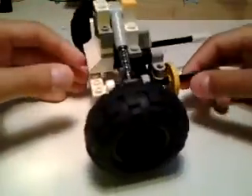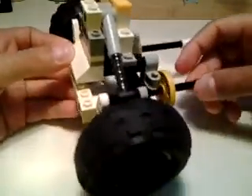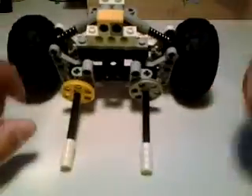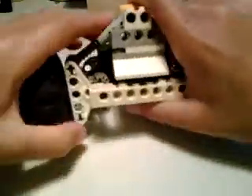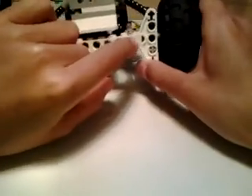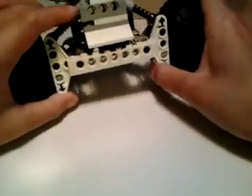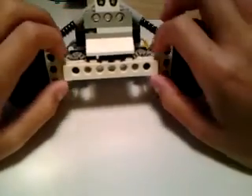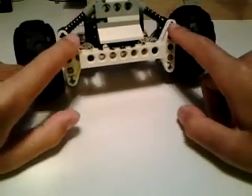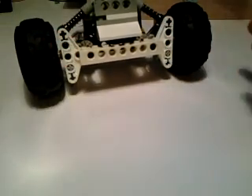Now, this is my independent suspension setup. As you may recognize, this is from the skid steer chassis which I built in another video. As you can see, you can turn like that. This one is built with independent suspension — it's tetra-type, because it has single pivot suspension arms. You can make this setup wider and softer if you use some L-shaped beams to extend it.